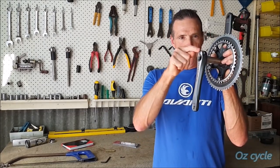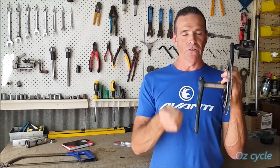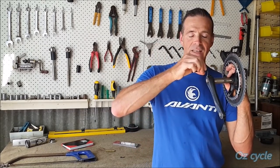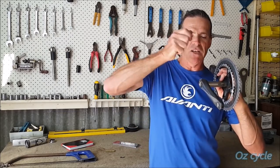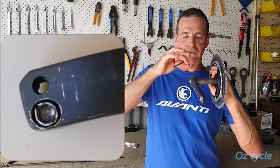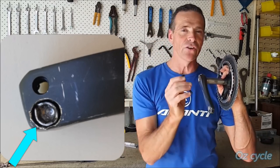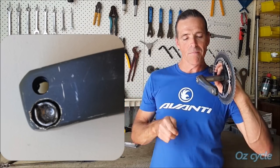But the outside bolt — with his 5mm Allen key he stripped the head. He couldn't fit a 6mm Allen key as they're too big, so he tried an imperial in-between size and hammered it in with a hammer on the Allen key, trying to spread the head a bit more, but that just stripped the head even more and made the flange even wider.